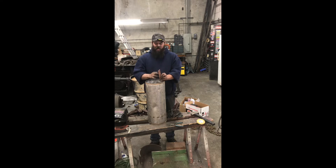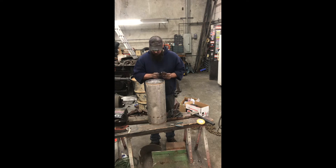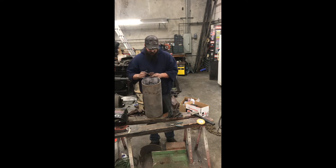These are just pieces of 55-gallon drum that I cut up — scrap material, 4 or 5 inches long. I've got a big huge pile of them and I'm probably going to need more. These are going to get welded in as fins and actually make the air deflect off of them. I'm going to stick a magnet on the back, drop it down inside, and turn it onto an angle. I'll line them up in a circle going around at that angle — because they're on an angle inside a straight surface, they're actually going to divert the air down and through, coming off one fin, between another one, smacking into another one. We're going to cause as much turbulence inside of here as we can — the more turbulence, the more heat that gets picked up.